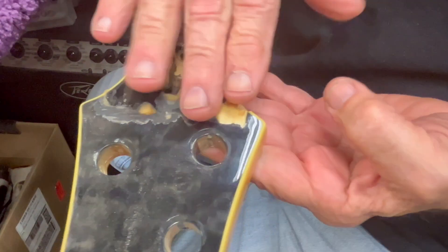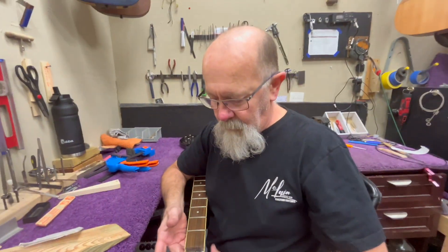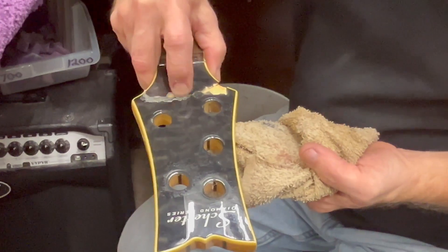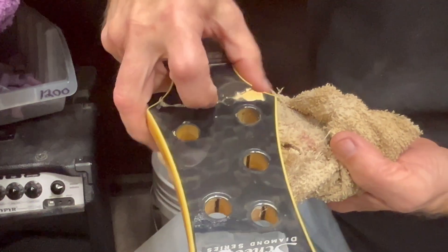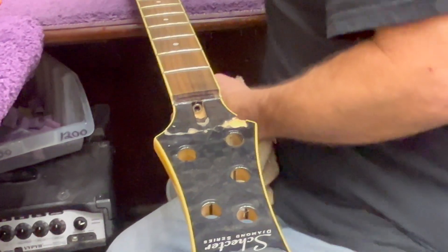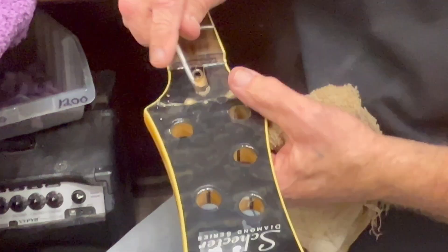The repair came out beautiful all the way up. We have a little bit of movement up here — I think that's just the way the neck bent as it broke. When we come back, we're going to dye this area black and use a black CA glue to camouflage the break area and make it look like the rest. Before adding coloring, I need to mention — get the excess dried glue off using a warm wet rag set on it for about five minutes and it just peels right off. We may need to do it a second time to get back down to the wood.